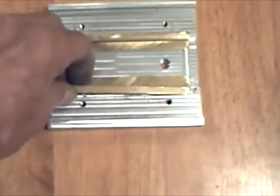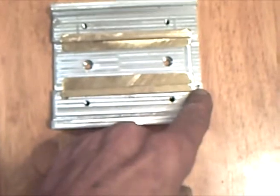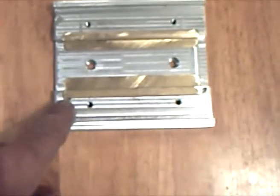This is the gib — it will be adjustable by set screws. And this is the stationary one. I overcut here — that's a defect. But that's what makes the sliders: this one is adjustable, this one is stationary.